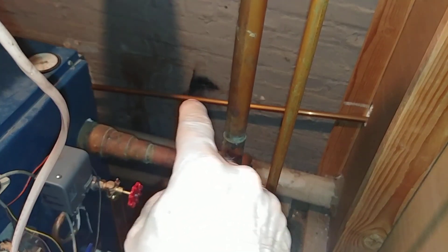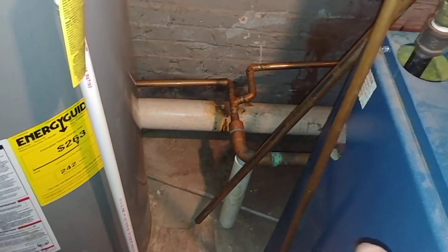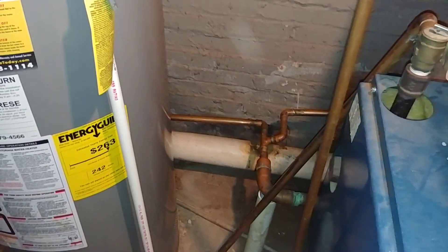There are only a couple of radiators hooked up. As you can also see, the returns are three-quarter inch on either end, which is a little small, and there's no easy access drain.